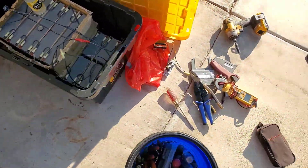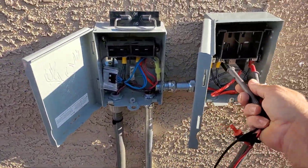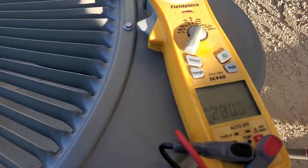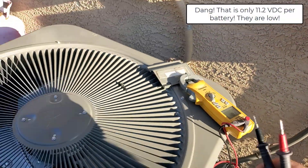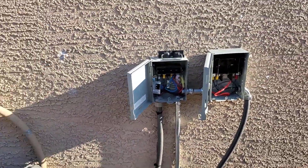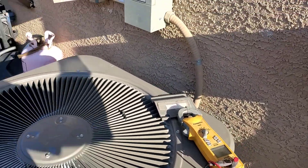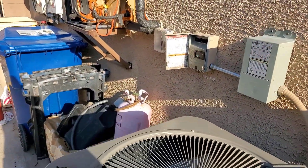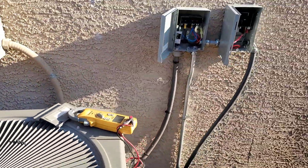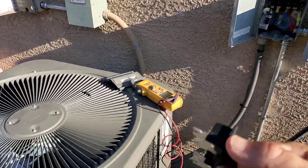The batteries I think are pretty low, let me get my meter out before the sun overheats my Samsung. Line side: 280 volts. So yeah, these batteries were already ran down — I started this at about 5:30, so it already diminished the batteries. I think that might be enough voltage to start this though. It's 280 volts DC. Their nominal is 230 or 240, and our utility power is at 243 — I've seen it as high as 250 — which rectified is closer to 330 volts DC.